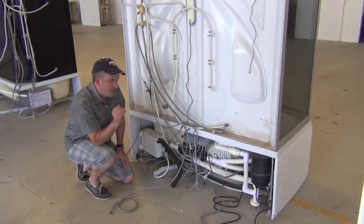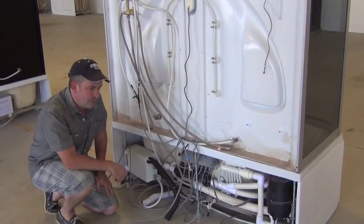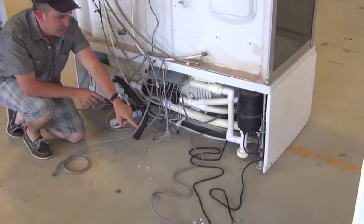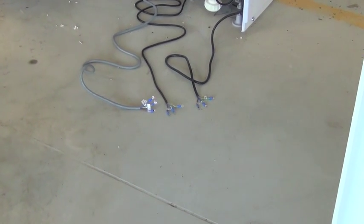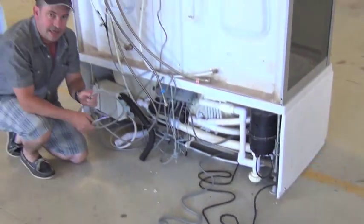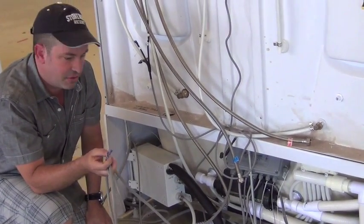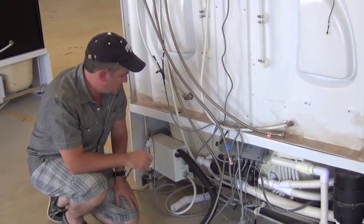For the electrical, all you're going to need is two dedicated 110-volt 30-amp lines. One of those lines will supply the power requirements for the tub — these three wires here will supply the power to the tub, so one 110-volt 30-amp line will be connected to those wires. Your second dedicated 110-volt 30-amp line will be connected to this other wire. So it's just two simple connections — 110-volt 30-amp — and that supplies the power to your steam shower.